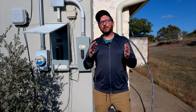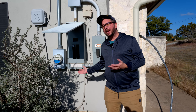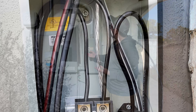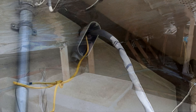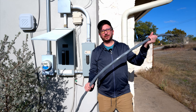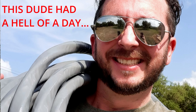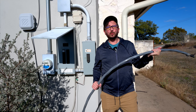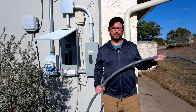Let me talk about what I did for this setup. We have our service coming into the house here — this is an aerial drop service — and we have a 125 amp breaker installed that is connecting up to the main run, pulled all the way through, about 85 feet of it through the attic with incredibly rigid, hard-to-manage service cable. Service cable is very difficult to work with if you're a single person, especially in a low-pitch roof situation. There's another reason it pays dividends to have somebody else do this kind of work, because one screw-up and you could fall through your attic.